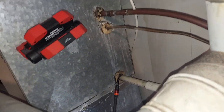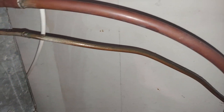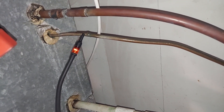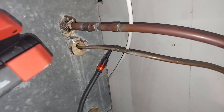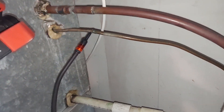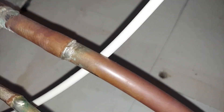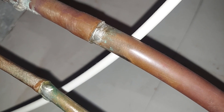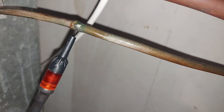All that oil usually means a refrigerant leak, but this oil I think came down the pipe over the years. So this is where the leak is actually at - you can still see the oil over there. It's not the top suction pipe - that's pretty dry and clean, no oil. It's on the bottom part, the liquid line.